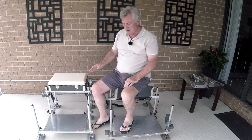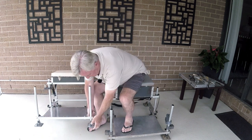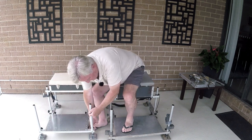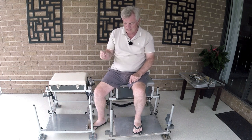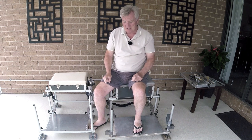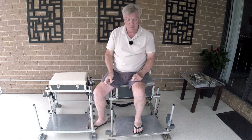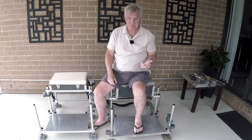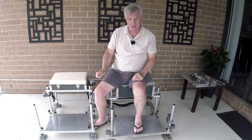Now where I did save weight was on the internal legs. The original box had 3mm walls on them, and that did make it quite heavy. So I've actually gone back to the days of yore when I used to use 1.6mm wall thickness. That always worked fine — I just decided that being a more robust box I might need them, but frankly I don't think I do, so I've gone back to 1.6mm wall thickness.